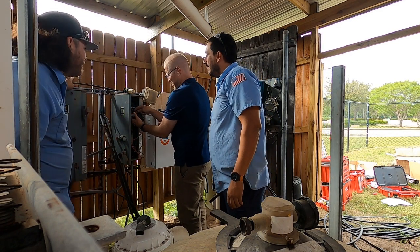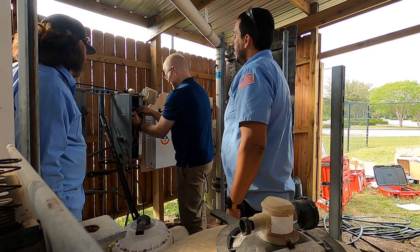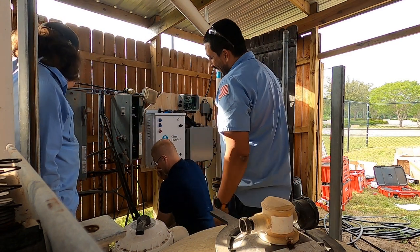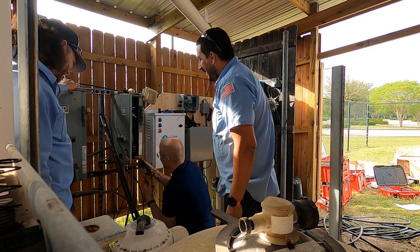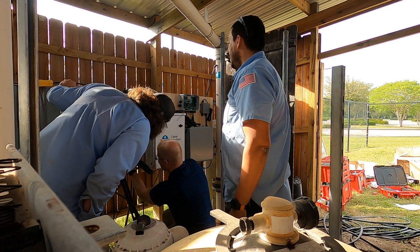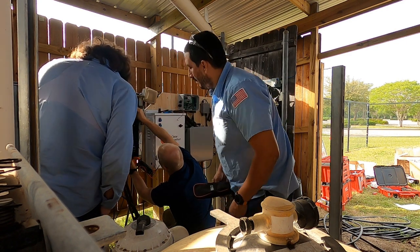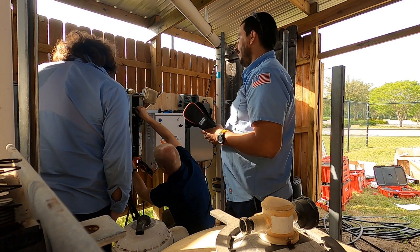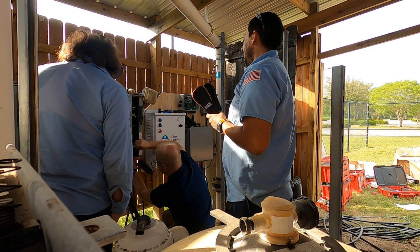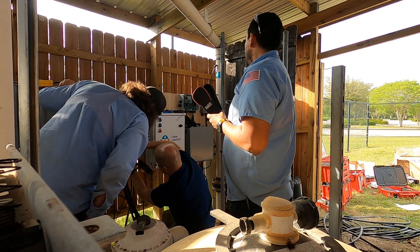Yeah, so right now I'm getting 0.001 volts between them. I test again, and between the lines, I'm dead. Which is good. Now, carefully grab my ground lug. Okay, and now I'm testing. I have, again, 0.001. The ground has 0. 0.02, 0.001. So that's just background, right? And I can check over here, 0.07, 0.00.